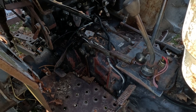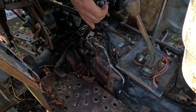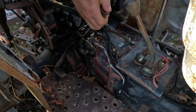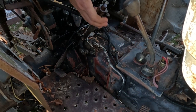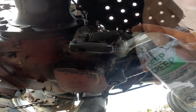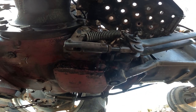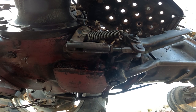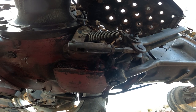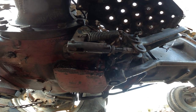The last thing I want to do today is adjust the parking brake. The tractor still wants to roll when the lever is fully engaged, which is obviously pretty dangerous. Like everything else, the linkage is really easy to access. Once adjusted, the brakes are fully engaged with about 4 clicks to spare. The tires are locked solid at that point.